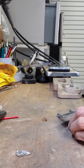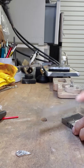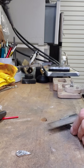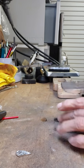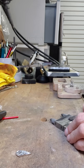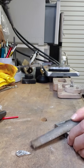And if you get into doing any type of silversmithing work where you're using hard solder, you're going to find that that really doesn't work. That does not hold true. You just can't gunk up solder with hard jeweler solder like you can with the low melt temp solder. So I just find it's really important in my work to not see solder seams. I think it really detracts from the look of the piece.